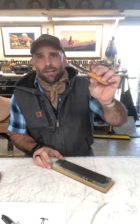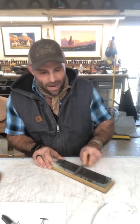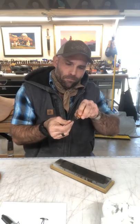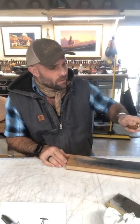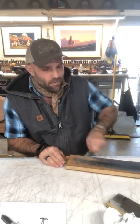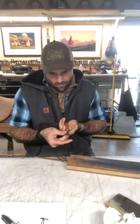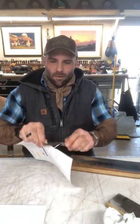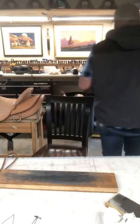As you can see with the straight blade knife, I'm not doing anything different than before. I am doing my little bitty circles here, rolling a burr to one side of the blade, rolling the burr back to the other side. Then I strop the blade and see where I'm at. If it's sharp enough, I roll on. If it's not sharp enough, I do a little bit more work. This knife is a little bit unique in that I never stone this one — it almost always ends up on the belt grinder because this is just a workhorse: part knife, part screwdriver, all business.